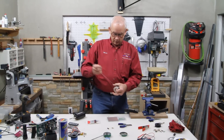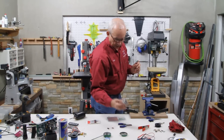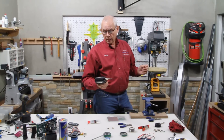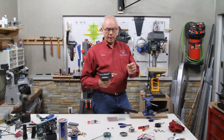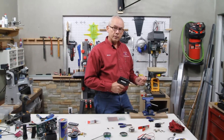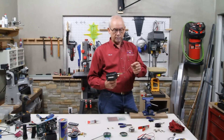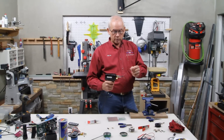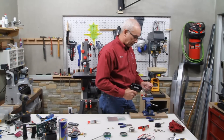I like to get started with a piece of solder that's not on the end of the spool because it's much easier to handle. Now what you're going to want to do is take your soldering gun — I have a 100-watt gun here. You can use something less than that, but a 100-watt gun will have enough power to heat up these sub-D connectors much quicker to allow the solder to flow more evenly. You'll want to keep your tip clean so it flows even better. You'll know your soldering gun is hot enough and ready to go when you touch the tip with your solder and you see it melt off just like that.